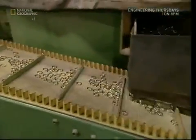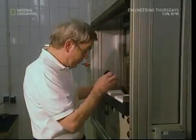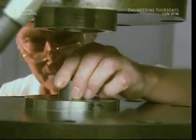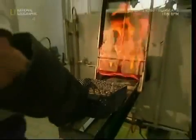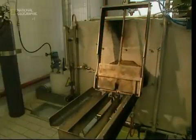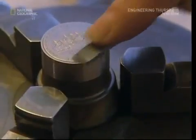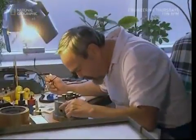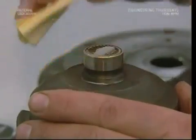So we've got our outer rings and we've already made up the fillings, but there's still something missing. All of our pieces are blank bits of metal — a template is needed to turn them into coins. The engraver's job is to make the coin equivalent of a rubber stamp. This permanently marks the value onto the coin. Using an industrial press, he crushes a pattern onto the stamp block, exerting 160 tons of pressure. The stamps are hardened in this furnace at 870 degrees Celsius. Without this treatment, the motif would disappear very quickly, but once it's been hardened, each stamp can engrave as many as 200,000 coins. The surfaces are scraped clean using fine glass to remove any imperfections, then they're checked and polished before being put to work.